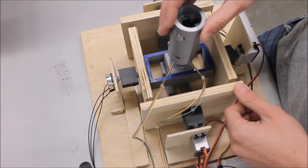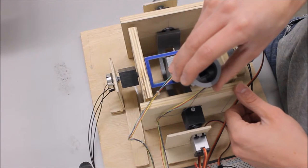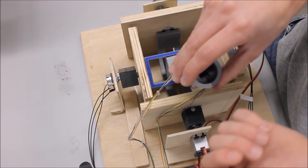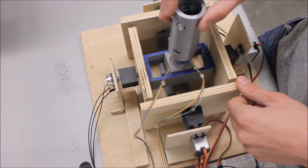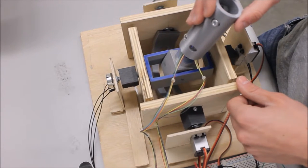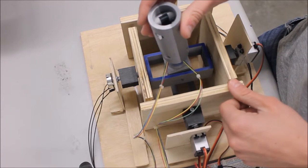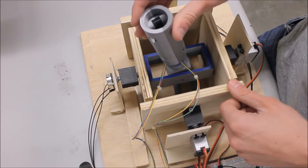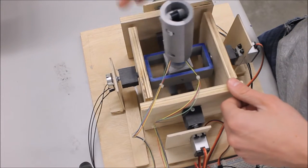So the further you get away from the center position, the harder it is to move the stick, the more force required before the servo will increase its position in degrees. And the servo, or the Sidestick, will naturally hunt for the zero position based on the fact that there's no force present on the grip itself.